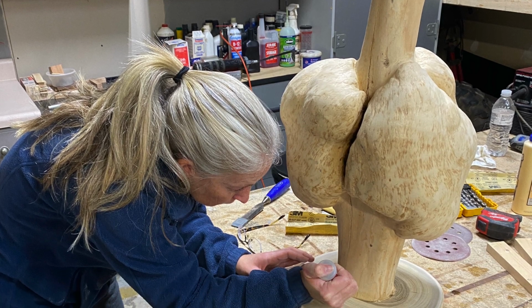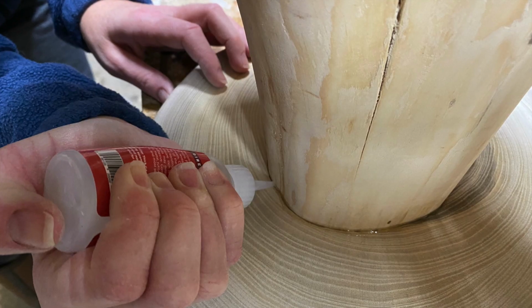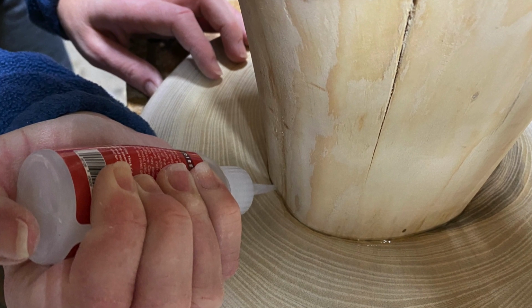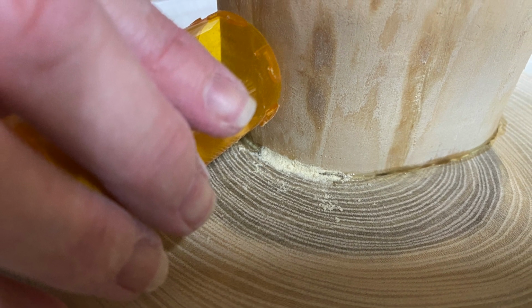In these pictures, once we had it countersunk and put in, it's not perfect. So there's a little bit of gap in the edges. We use this glue. I'll put a link in the description for that. A little bit of sawdust, and then the activator, of course, and then we could sand that down to sort of pretty it up at the bottom. One of the little tricks about keeping things nice and tidy.